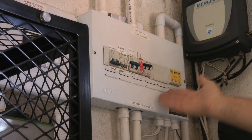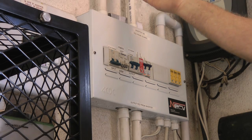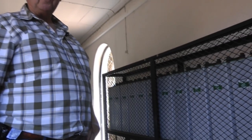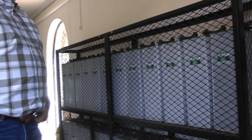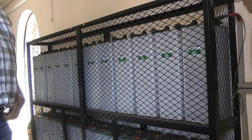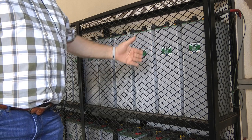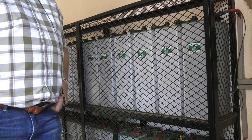This is a single-phase DB board. From the house you will have your AC — your municipal electricity will come in. Here we have 24 2-volt cell batteries, which makes up 48 volts. This is a 48-volt system. These are flooded lead-acid batteries, which are very long-lasting batteries, designed specifically for solar applications.